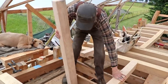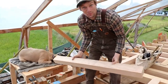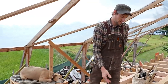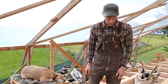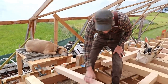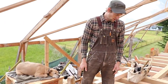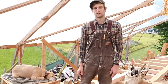I am lining out what you call half beams or spur beams on this side of the pond. I'm notching them into the carlins with a half dovetail. Half lap, half dovetail joint. And so I'm lining them out on the carlins, lining them out on the beam shelf, and then projecting a whole bunch of lines to get the notch right. Yeah, right? That's what I'm doing.